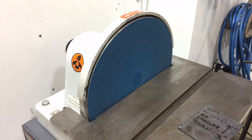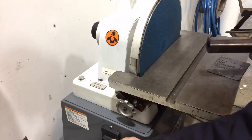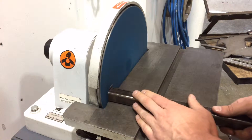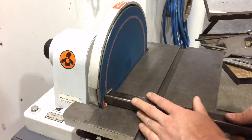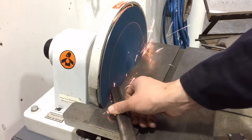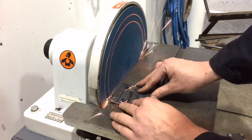So those are the basic tenets of using this machine. I'll fire it up and show you a quick grind before we call it quits. I'll do one of our common tasks here — deburring a piece. We'll get the dust collection system on in the back, tune this guy up, clear that table off, and rotate that part around. So now I've got a pretty nice part. If I want to bevel the edges — that's a good bevel. The other thing you might find yourself doing is taking the burr off and always keeping it moving.